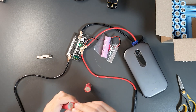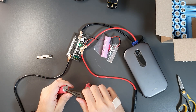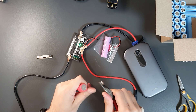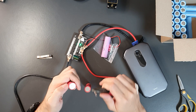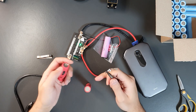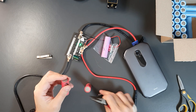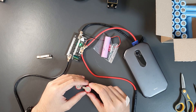Testing with a single cell at level two — it's quite hard to remove by hand. The strip is actually stuck to the battery and we're ripping the strip itself, not the weld joint — that's how you know the weld is strong enough. You don't want to overpower the device because it may puncture the cell casing, causing leaks. It's always better to start at the lowest level and increase from there. I found that level two is best for welding with this nickel strip.